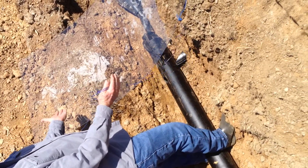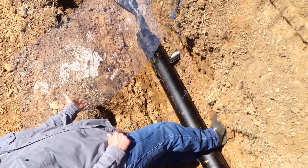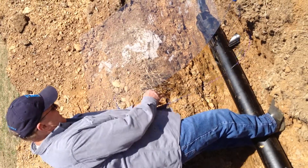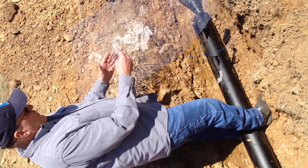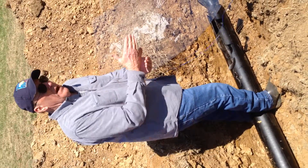It's up in here — that will be what actually opens it up. This is a cast, so this is a fracturable metal. If it was ductile or steel, it would just cut it straight and leave it open a little bit. And then when the expander comes through, it would open it up more like that and make a nice cradle for your new pipe to come in.